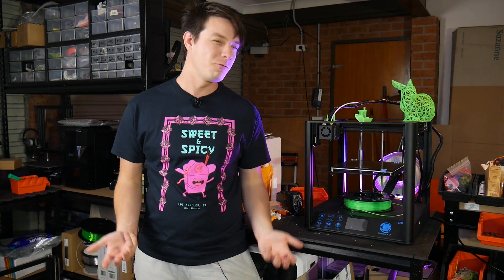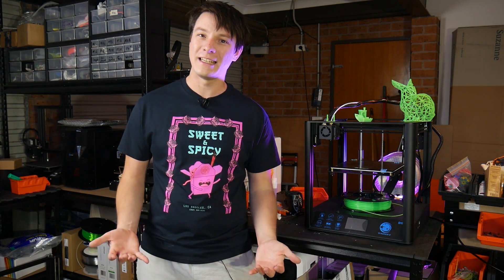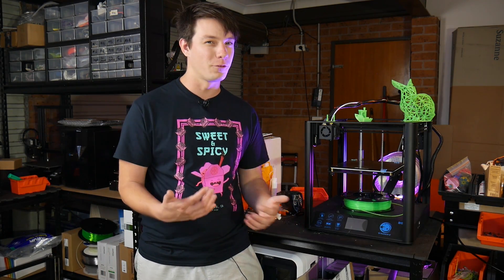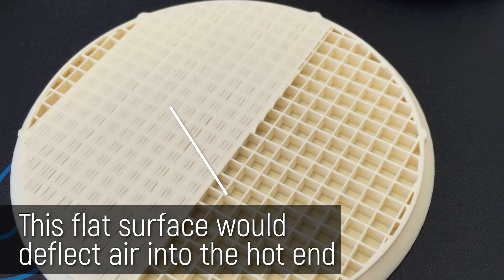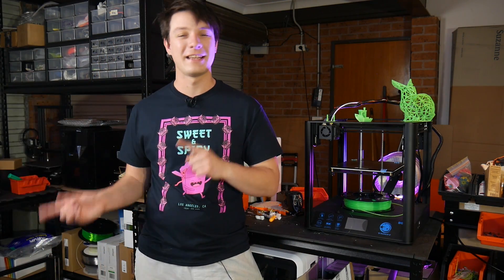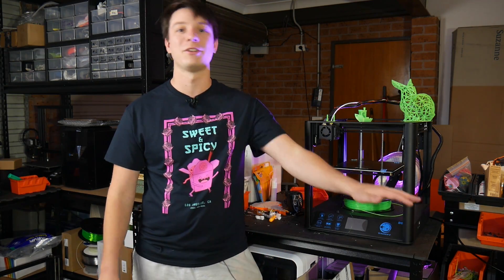Now there are a lot of questions raised here: why wasn't it done in the first place? Why did it take a YouTuber to put them in a corner where they had to update it quickly? My theory is that way back when this firmware was originally forked — from the Chitu board or possibly from Marlin — thermal runaway protection would often trigger accidentally. This was actually a big issue with the Prusa Mk2 where the cooling fan was so strong it would bounce off a big flat print into the hot end and prevent it from heating up enough, triggering thermal runaway. I think someone somewhere disabled it because they were getting incorrect errors. But it's 2019, the hot end on this machine can heat up very easily, so there's no reason for thermal runaway protection to be disabled on any machine currently on the market.